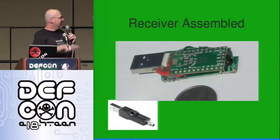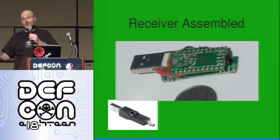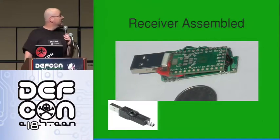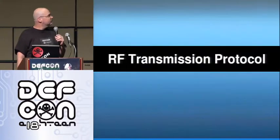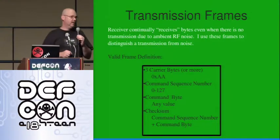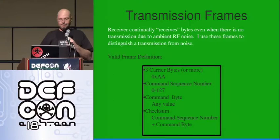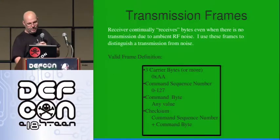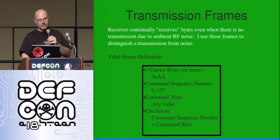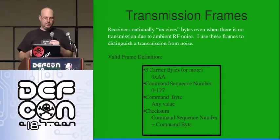The actual adapter is available from Deal Extreme. I buy lots of junk from them — it's a great place to buy cheap electronics from China. It turns out the receiver is always receiving bits: it's picking up noise and it's deciding one, zero, one, zero. So you get a continuous stream out of it. That's kind of difficult, because we're looking for particular information. So I built a simple transmission frame to deal with that.